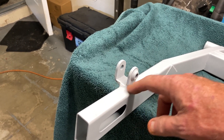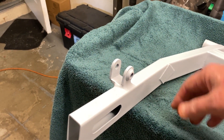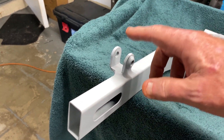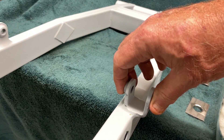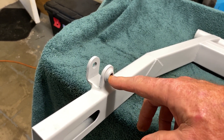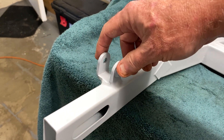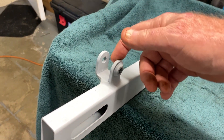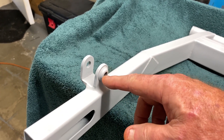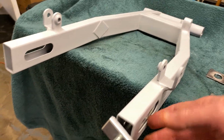So instead of doing that, I filled the low spots in with some JB Weld — essentially like if you're doing body filling — and sanded it all and it looks really good, blends it in. There's a crap load of weld on both of these, and I welded in the M10 nuts on the back side. I welded these in, and while this was off, I just put a bolt through with a lock nut on the inside, put it in the lathe, and turned that back to clean it up. There's plenty of threads on both of them to lock those in, which really works well. I'm really happy with that.